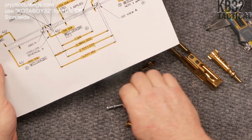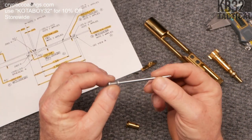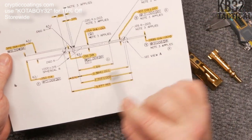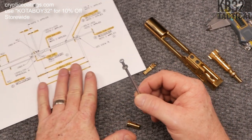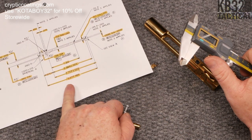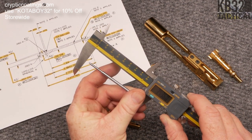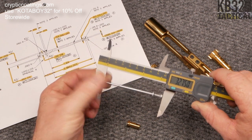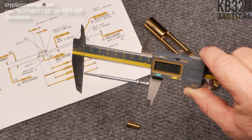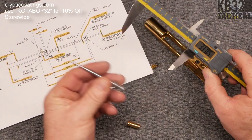The firing pin is a firing pin, but I will tell you I've had firing pins break on me - I've broken this little piece off right here. What I'm trying to convey is that you can go online, look at this stuff, and mic out these dimensions. For instance, the overall length of a firing pin mil-spec should be 3.277 inches. Let's see what this one reads - I'll hold it up right there. It reads 3.2750 - not bad. 3.2755 - I'll give it the benefit of the doubt. Down to the thousandths, pretty cool.